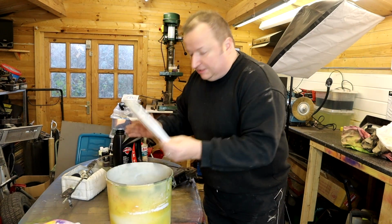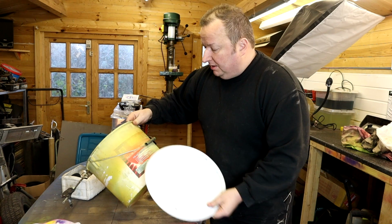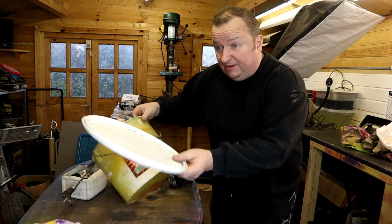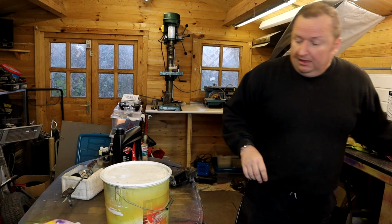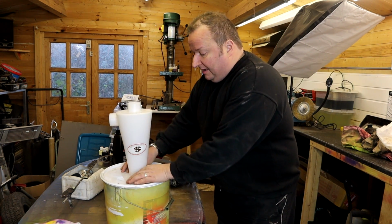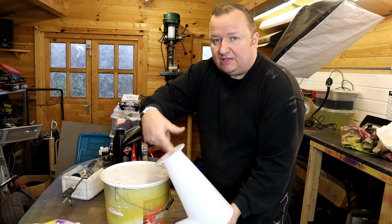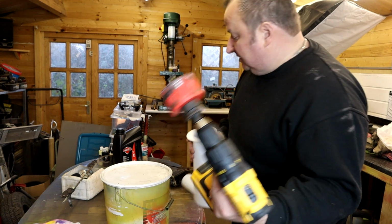Right, okay, so this is my plastic container, which came with the grit. You can get these cheap anyway. This came with a gritting for me, aluminium oxide for my sandblasting cabinet. So I'm using that, and I'm going to fit that on there like that with some screws, and that means me drilling a hole in the bottom, which is that sort of diameter. So I've got this cutter here to do that, so let's get that done.